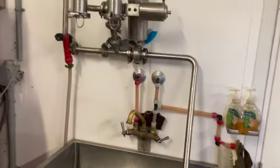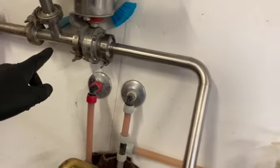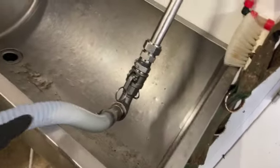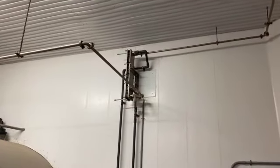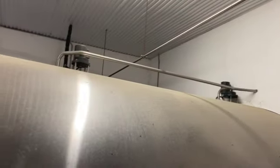From the twin filters it goes down, and then when we're separating milk it either goes down the drain, or into the hole in the tank. Or it goes the other way, back up through the plate cooler, which cools down the milk a little more, and then into the tank.